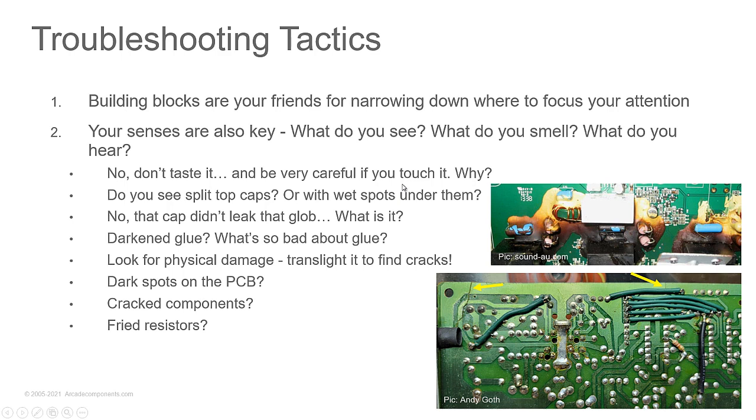The glue becomes conductive. You remove it. You need to stabilize the parts. If you use hot glue, those circuits get hot. The glue gets runny. You don't want to use hot glue because of that. RTV silicone is great for that. But the problem with RTV silicone is that it leaches acetic acid. What's acetic acid? It's vinegar. What does vinegar do to electronic components? It corrodes the leads. So you got to be careful with that.